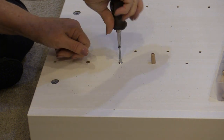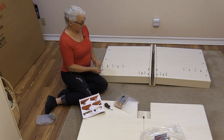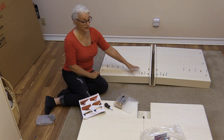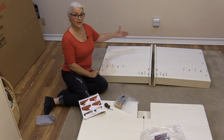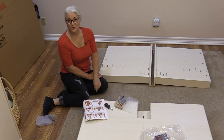The larger holes are going to fit those wooden dowels. Put that wooden dowel in there and then take the end of that screwdriver and just tap it in. The rest of that cam lock has a little screw on one end and that screw part will go into those smaller holes — you can't go wrong because it'll only fit the right size hole. Use the little star end on the screwdriver, hold it, and start to screw it in. Once it gets going it's very easy and it needs to go all the way in until it doesn't want to go any farther. For each side of the leg we're going to need five metal screws and five wooden dowels, all on one side.